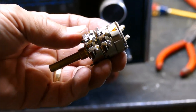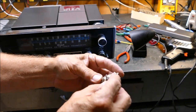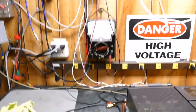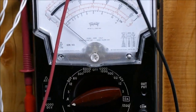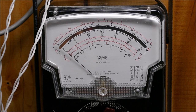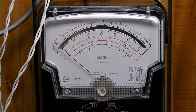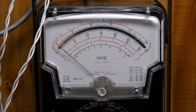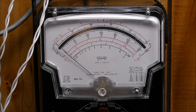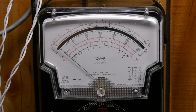If you replace one of these pots, you will have to pull the center part out of the knob to get it to line up again. Let's see what's wrong with the old pot - I'll look at the meter. It's a 750k pot so I'll set the meter on 100k and just measure across it from one side to the other. There it is - it's open! Completely open on the 100k scale.